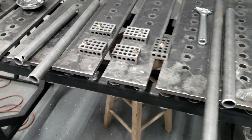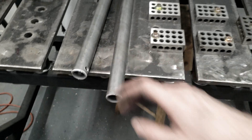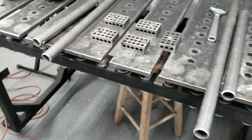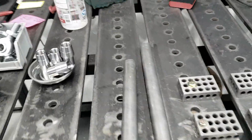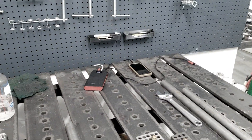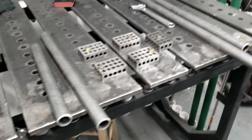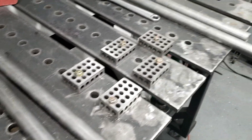We got the bars cut out and the ends prepped on the upper link. I drilled some spot-weld locations to reinforce the upper link — it's the most stressed link in the entire setup. The camera cut out during some of the prep work so we're on the backup camera, but I'll get these all cleaned up and then we'll get ready to weld.